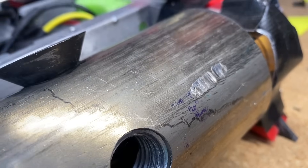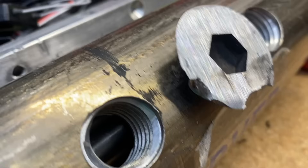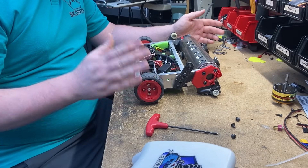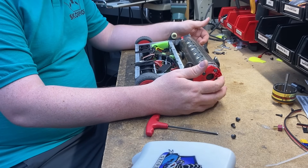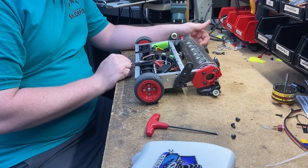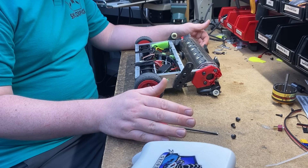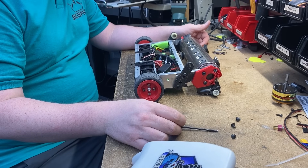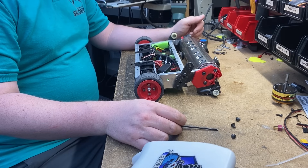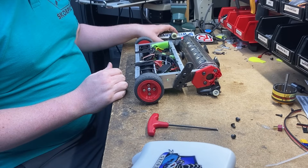Nightcrawler also told me a six-pound drum is crazy, and I should really try to only do four pounds — a good piece of advice, which I will take since he kicked my ass. I'd say those are my two biggest mistakes: I should not have TPU'd the skids, and I should not have gotten away from four wheels, because I should have respected center of gravity. The wood floors definitely make it so you have to respect the center of gravity being over your wheelbase. And I should have updated the weapon motor — I took the time to update the drive system, and if I had updated the weapon system too, this robot would have had a much better chance.